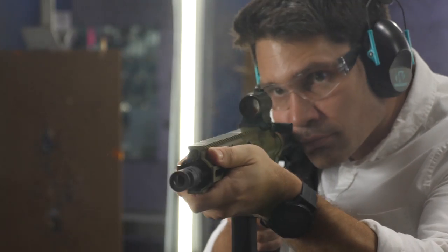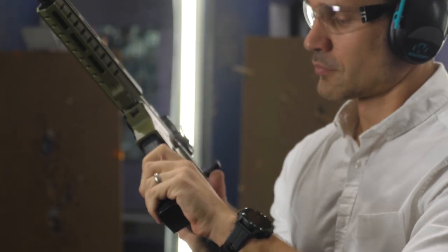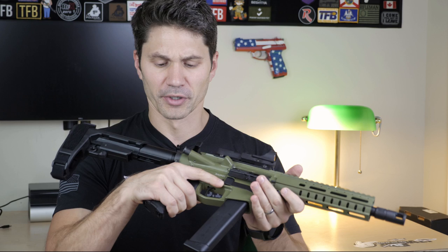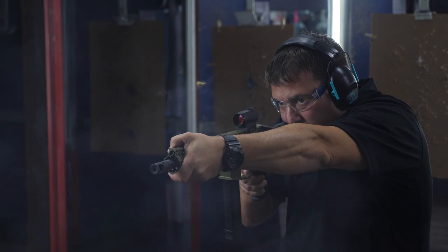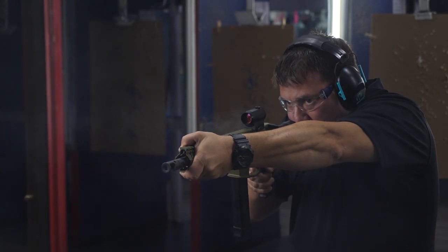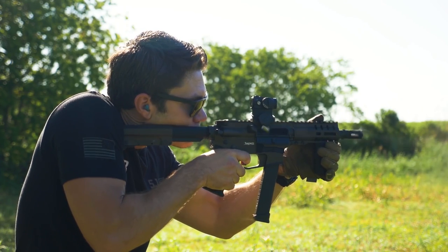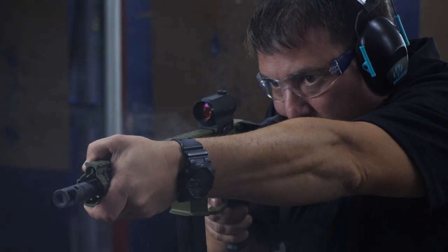We kept the H3 buffer in when shooting factory 10-millimeter ammunition, and it cycled 100% of the time. As far as shooting impressions go, this is about as good as it gets — this thing was milder than New York jambalaya. Really easy to shoot, almost no recoil. The four-port brake seemed to work very well with the H3 buffer and the radial delayed blowback system. I was familiar with the platform but it had been a couple of years since I shot it. When I shot the Banshee 9, I thought it had noticeably reduced felt recoil, but in 10-millimeter you really notice the difference versus 9mm, which is somewhat anemic even out of a standard blowback.